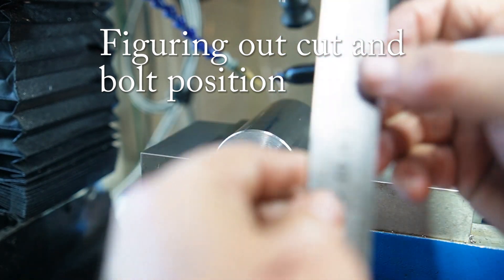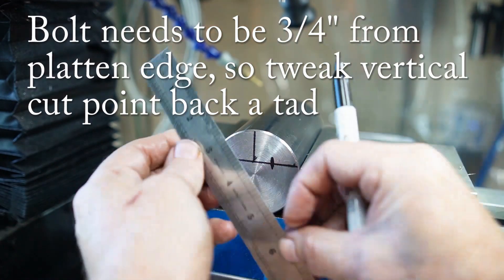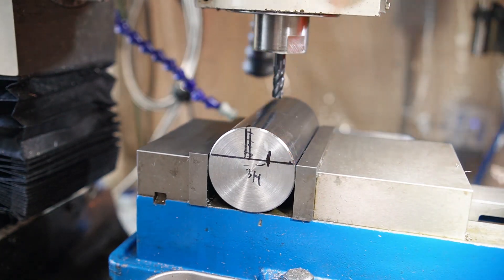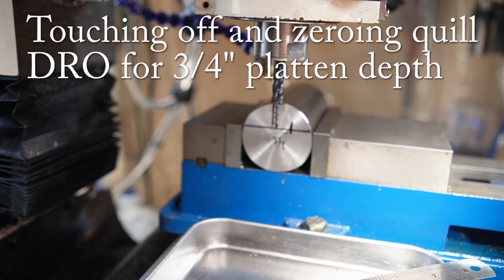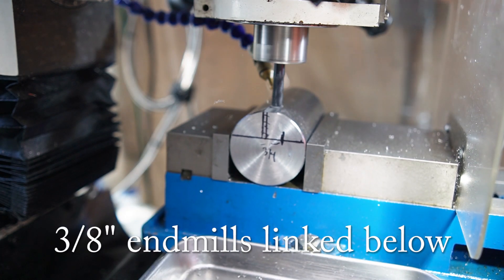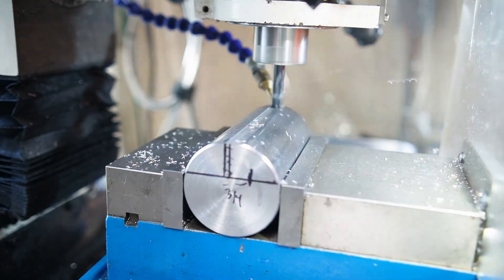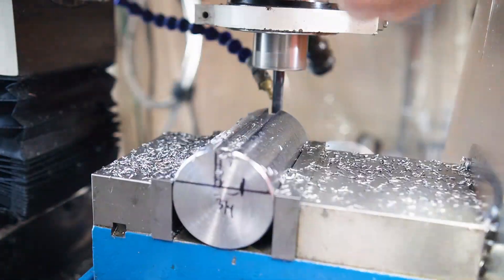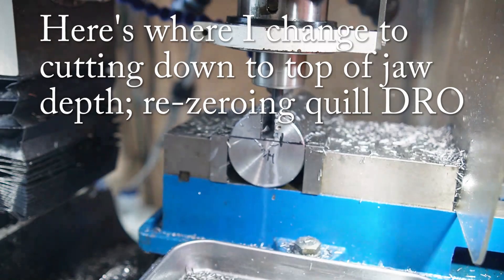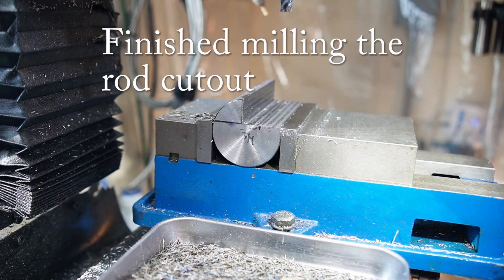Back on the mill, I'm roughly figuring where that notch is going to be to hold the platen and where the bolts are going to go. I figured they need to be three-quarters of an inch from the edge of the platen. I couldn't quite get three-quarters, so I went a little behind the center line on this cut. I tend to use three-eighths inch end mills because I buy them in sets of five and they're pretty cheap. There's lots of metal to remove here, so lots of passes — starting off lightly, then getting more aggressive. I changed my plan midway and ended up going deeper than three-quarters, all the way to the top of the jaw face. So I've got a very deep notch there.